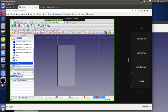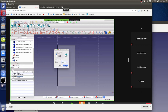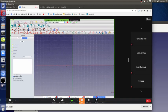We're going to have an electrical box that we put in, and it goes into the panel, and we're going to attach it to, say, a left stud. So it could be a switch. What you do is you put in electrical boxes where you then put in a switch, or you can put in an outlet into it. So let me see if I can actually share.